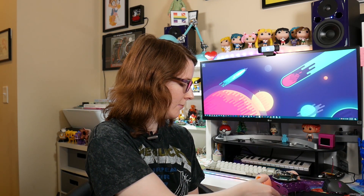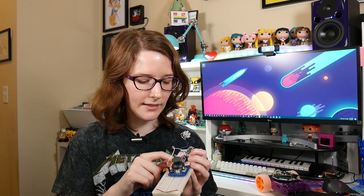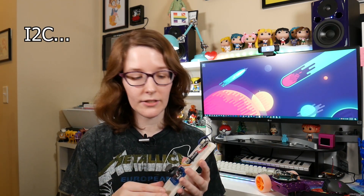But what I found when I was originally testing was that the Circuit Playground's IR transmitter wasn't quite powerful enough to reach the Circuit Playground on the Cricut board, just because of the angles and everything. So what I ended up doing was changing the remote design a bit to use a Trinket M0 — I'm still coding in CircuitPython — and then I'm using a Seesaw board, which is a little add-on processor that allows you to do a bunch of stuff like analog control, all through SCL and SDA communication. That's how it's connected up to the Trinket here on the breadboard.